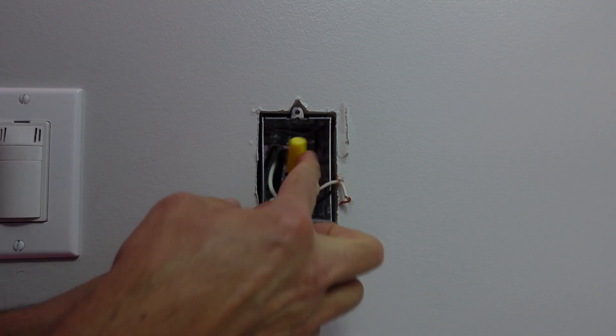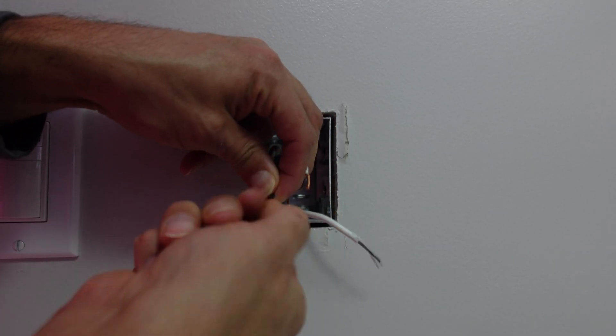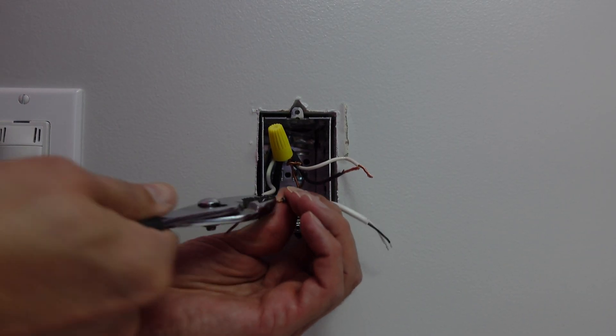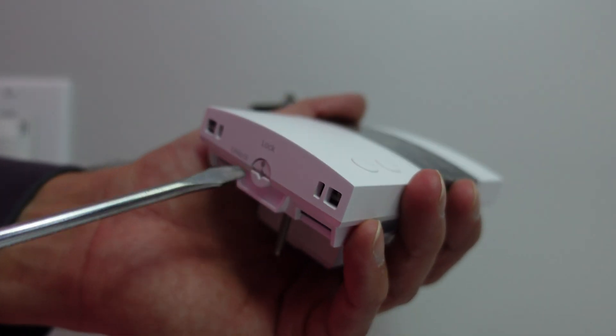In my case both are marked with little paper tags, so I'll go ahead and pull off the marrettes. After the marrettes are all pulled off, you'll find one that's grounded to the ground box — re-marrette that connection and put it back in. Twist off any wires to make sure they're cleaned up, and if they're bent you might want to grab a pair of pliers and straighten them out.